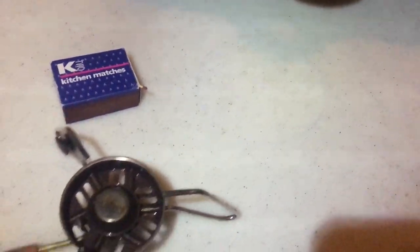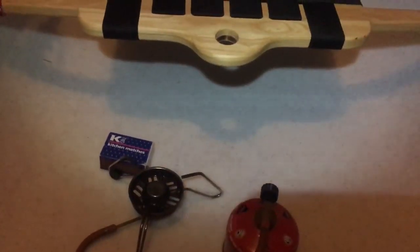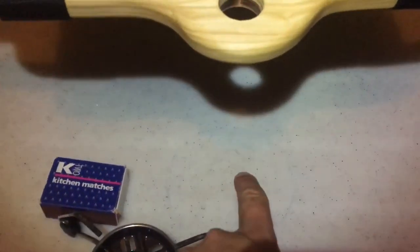So here we go into the garage. I'm working under torch light indoors now. I've moved the boat indoors to get it out of the rain because I'm going to be fitting the sail foot mount. Here's the small faint blue area that I've marked on the boat. Because the boat is brand new it's leaching lots of oils out of the plastic, and that's going to stop any glue sticking to the hull easily. So I've got to actually encourage the oil out of the boat by heating it — I'm going to use a gas stove underneath this seat to heat that little blue patch up to bring the oil out and make the glue stick.